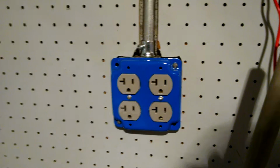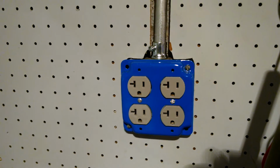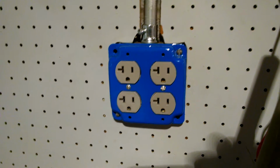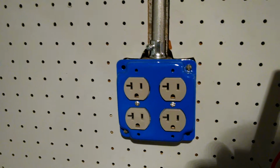With an outlet that's going to be running potentially a heavy load, you want an absolute minimum of voltage drop, especially if it's a continuous load, because you're going to be paying for that electricity loss. If you have a 15% voltage drop on your outlet, and it's running something like a dehumidifier, that's actually going to add up.